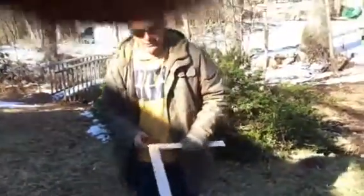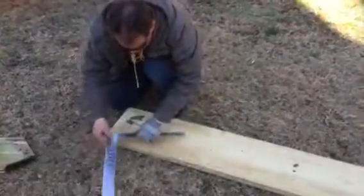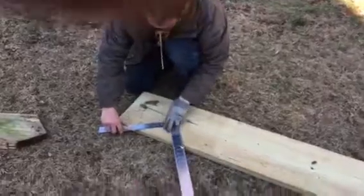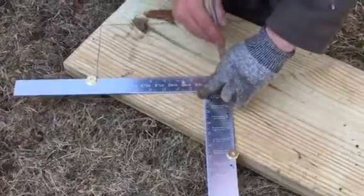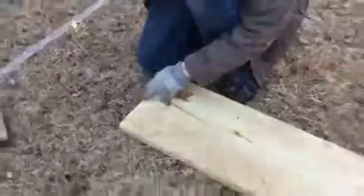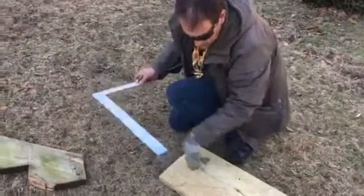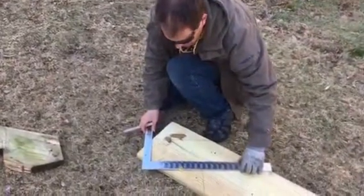Now you've got a fresh piece of wood here. The bottom angle I already drew on, but you can make that whatever you want. Your first step — as you can see, it catches right there. I already started this one. If you don't have it the right length, this is just a 90-degree angle. This is gonna be the very front of your steps and the bottom. You're gonna put a board here so you don't kick your foot through — this is what you're gonna stand on, this is the kick plate. You just want a 90-degree angle here.